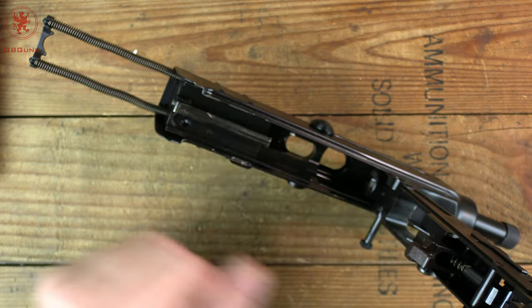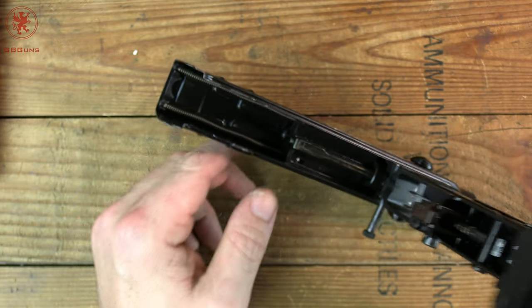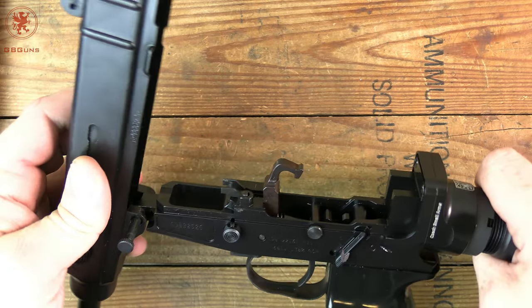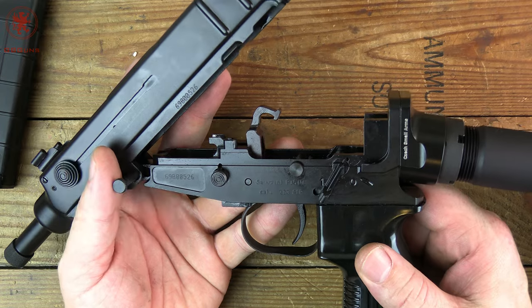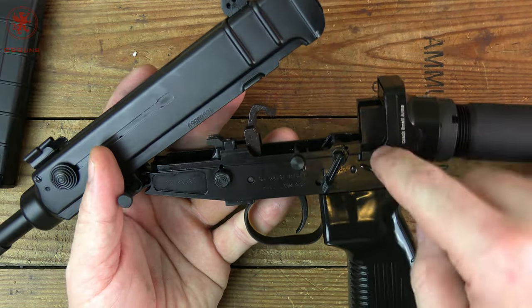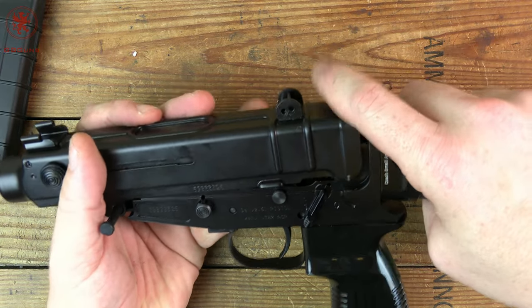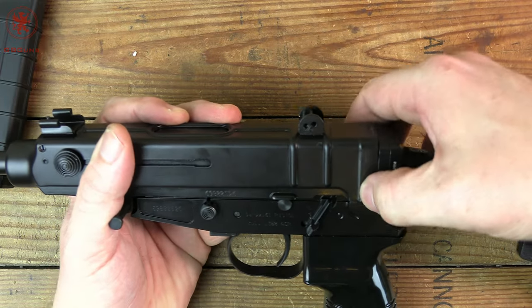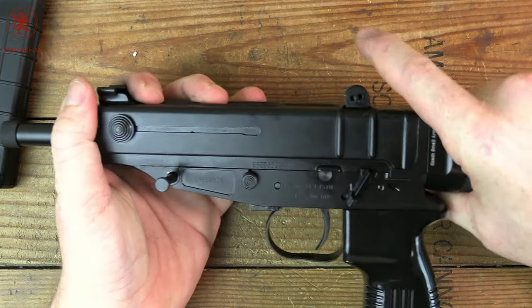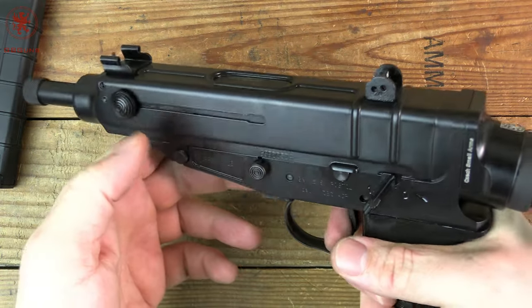It's a nice solid reciprocating mass, with two springs each on their own guide rod to keep everything centered — very simple, very classic 60s sub-gun design. Reassembly of the Scorpion is a little different. Since this is stamped sheet metal, you've got to make sure that these ends end up inside this bracket. Bring it down, back, squeeze in on those, and once it's all the way down, push back on the top so that the holes for the pin line up again, pin back in, and we're back together.